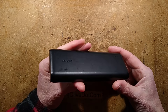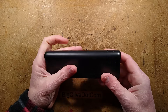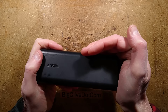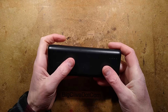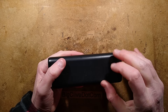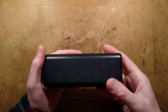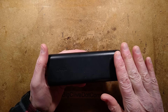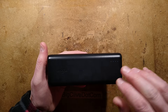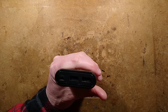Let's take a look at a faulty Anker power supply. This unit was given to me by a friend called June. When you push the button on the side, the first LED — it's very dim — starts flashing. When you plug it in to charge it looks as though it's charging: the LED lights up, starts flashing, and it draws about an amp. But after a while it's really warm at this end and you can see with the thermal imaging camera the outline of six 18650 cells in here. It's just getting hot and not actually putting a charge in, so let's see if we can get this open.